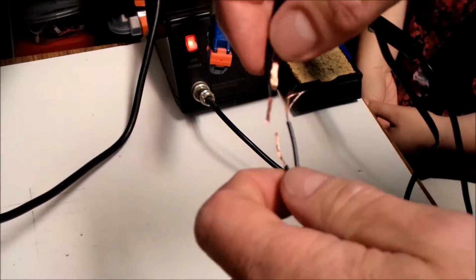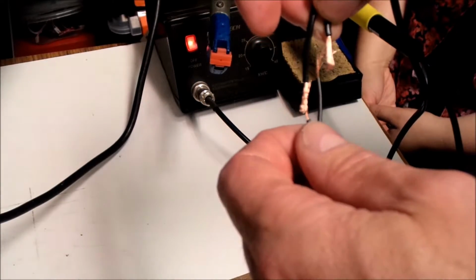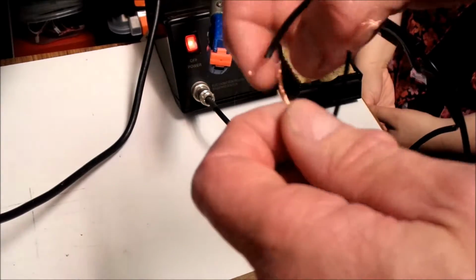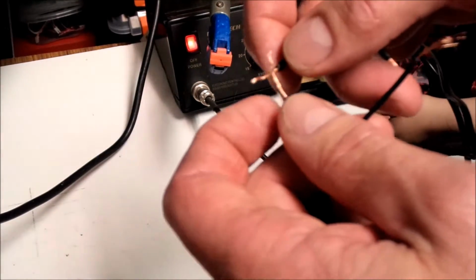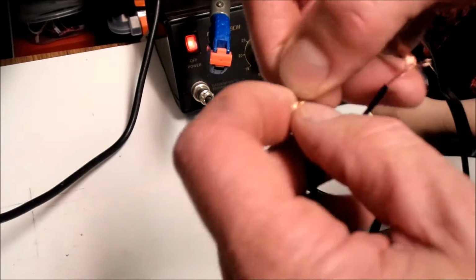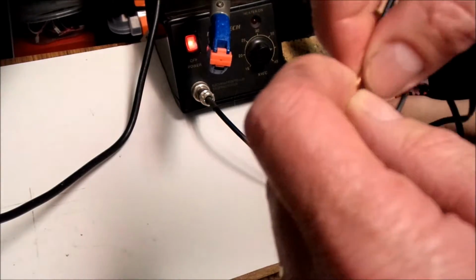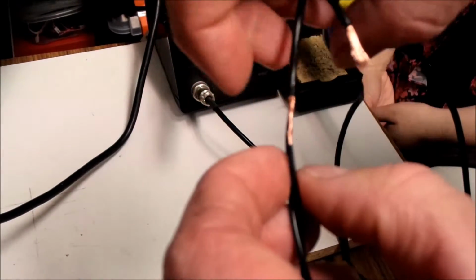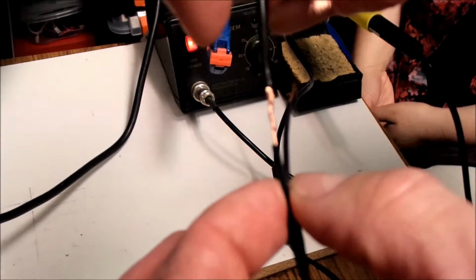Now we're going to join the wires together, and as you can see why I've staggered them, because it's quite easy to get it right now. So I'll do this one first, and then I'll get Kara to do the second one. With this method, you go roughly halfway down the wire, and you bend them opposite directions like that. You twist it that way, hold one wire, twist it the other way. There's little daggy bits hanging on the end, so you just stretch it out a fraction, and then give it a little twist. Believe it or not, it's actually quite tight even before we solder it.